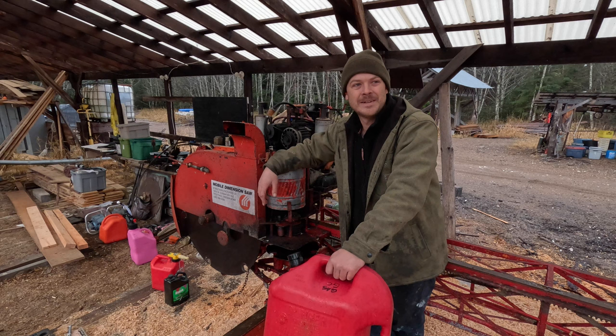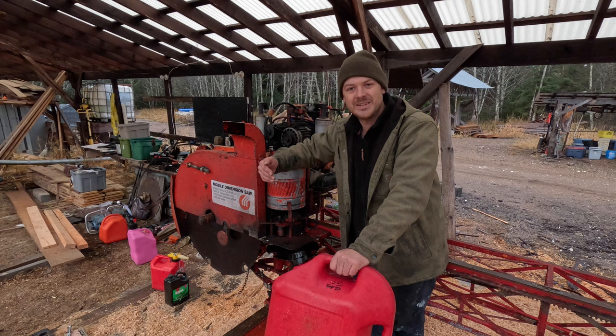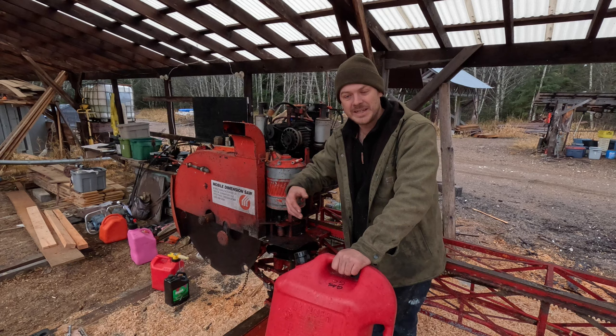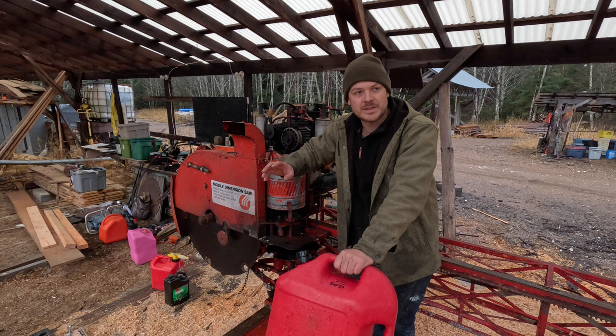The simplest way to think about this mill's alignment is just that the blades need to run parallel to the direction that they're cutting. You read the book, the edger blades are tipped down just slightly, and that's really easy to do. I'll show you how to do that. But don't overthink it. The blades just need to be parallel to the direction that they're cutting. And if they're not, it's really easy to tell. I'll show you how to do that as we go.